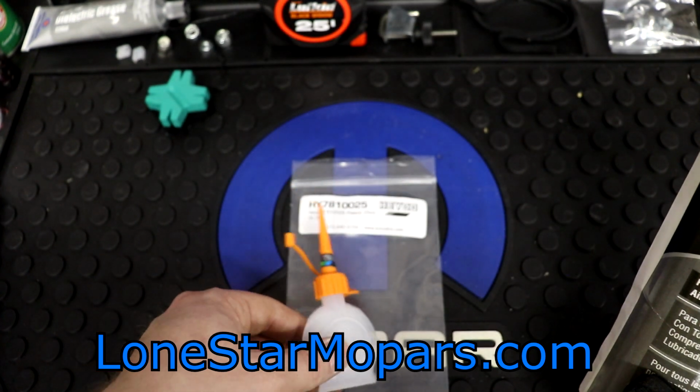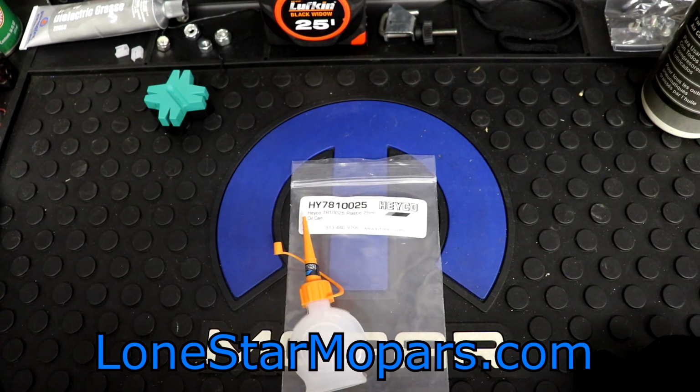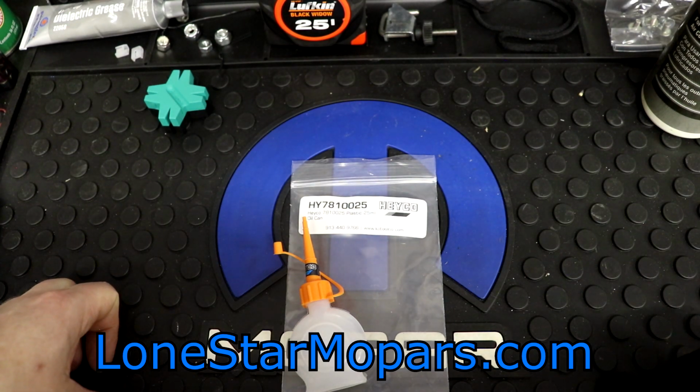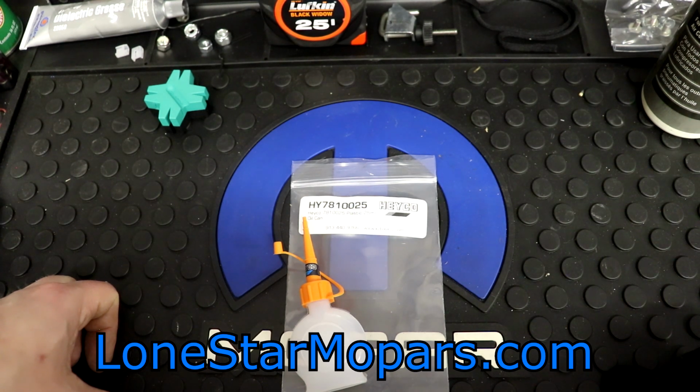And it's a deal. I feel like I'm the only person that oils air tools. It might be because when you can do the purchasing, you're kind of like, oh, well, if we would have just oiled that, it wouldn't be dead after a short life. It's amazing how long pneumatic stuff can go just running on the moisture in the lines, right? But if you just oil it, preferably daily, you can be going somewhere. So, do they make automatic oilers? Yes, they're a pain in the butt. And again, the bigger issue is people don't keep the oil filled.